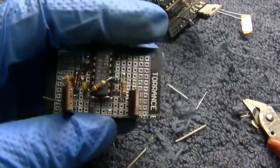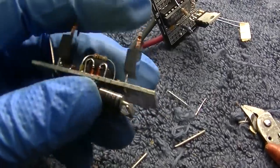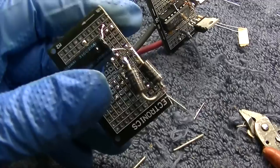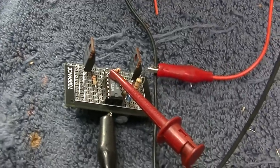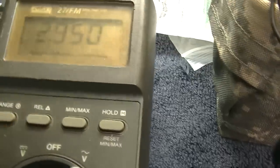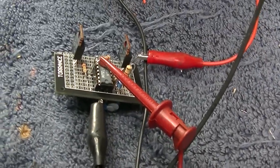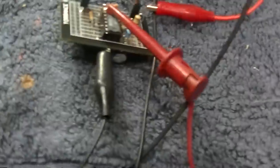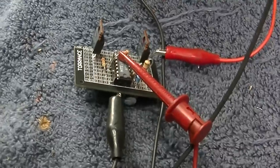I'm trying to keep it very small so it will fit in the radio. I had to take a break because the rain was starting to flood everything, but I'm doing some checks now. I've got 6 volts on it and I'm measuring the AC on the gate of the FET - I got 2.95 volts there. I'm going to assume the thing is working right. I'll grab a transformer and listen to see if it's buzzing at about the right frequency - it should be right around 100 hertz.